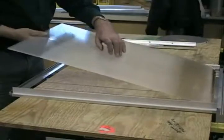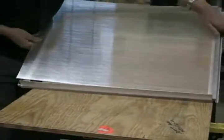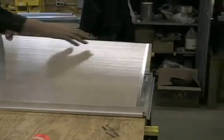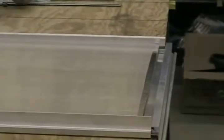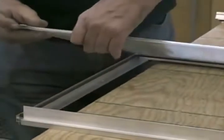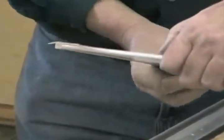Now to put it in, we slot it into the back, and it should go in underneath that lip on the rear hinge plate. One thing I must tell you to note is that one end of this unit is taped, the other end isn't. The end of tape goes up under the ridge of the hinged end. This is the eave retaining plate which we'll put on the end that's open. You'll fit it on, as you can see, it's got a slot to it. You'll just put it on and give it a push into place.